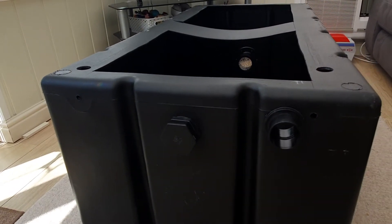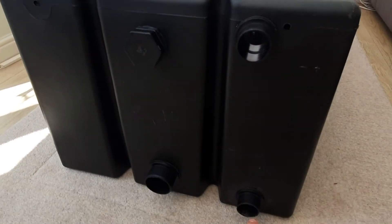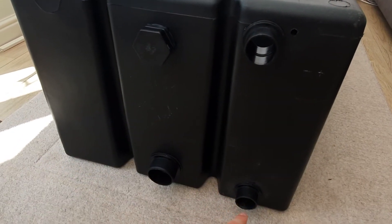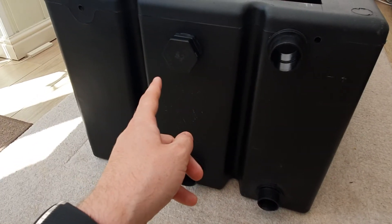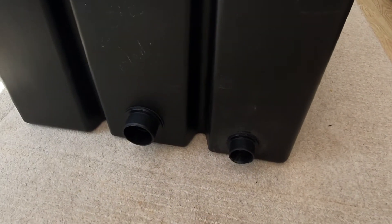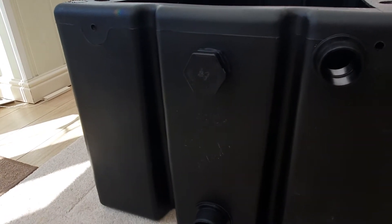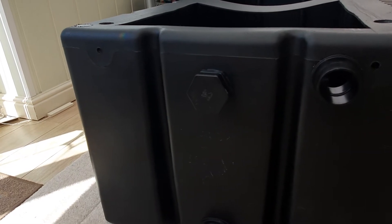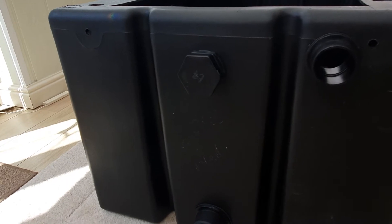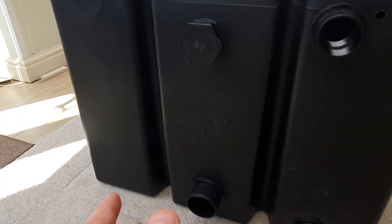Because this is a water tank — a plumber-style loft one — you add one, two, three attachments. We had a couple of valves and then a tap there, so I've cut them out. You can use that one as an overflow, you can use that one as the waste valve, and then that one sort of in the middle — I thought, what can I do with it? So I put a tank connector on with an end cap which has a rubber seal on, so that's watertight now. Because of the side it just looks a bit odd in the middle, so I've adapted it so it's covered up.